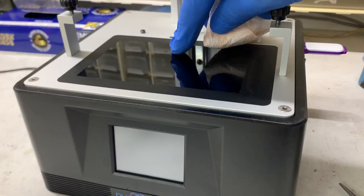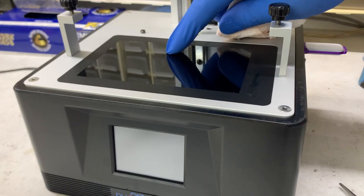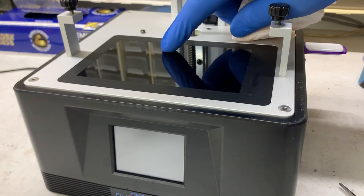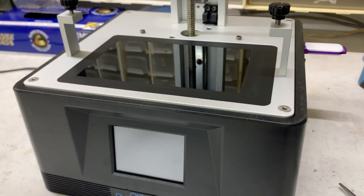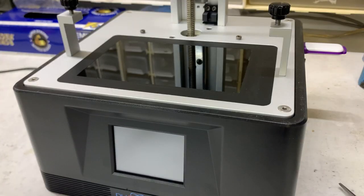It's important to get this absolutely flat, because even a tiny bump will dent the FEP and lead to another hole. It also makes leveling difficult — even this tiny amount will impact the leveling of your build plate. That looks good, though there's a tiny blemish I'll clean with a lint-free optical cloth before reinstalling the tray.